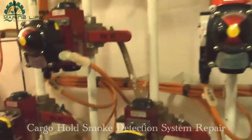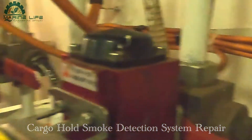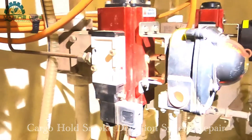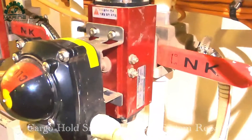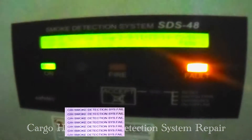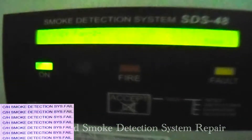This is the actuator, which as I said can be operated manually by handle and can also be operated remotely because this is a pneumatic actuator to operate the valve - the solenoid valve. In closed position it is in sampling mode. In case of fire, you can change the direction. Now the system is on - you have to reset the alarm. Now the system is working normally.